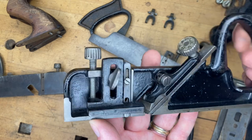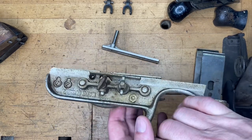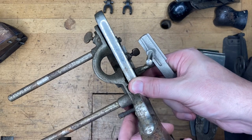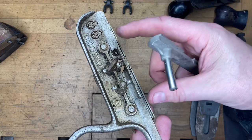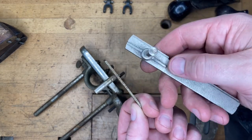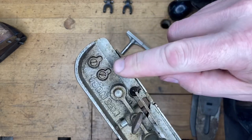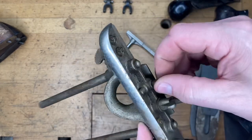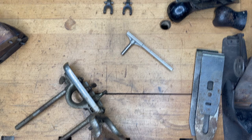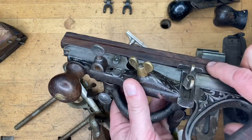There's another question that's come up lately: folks ask if the number 45 components are compatible with the number 50. This is a number 50 — you can think of it as a miniature version of the 45, a light combination plane. The stem on these for the depth stops is significantly smaller, so the answer is no — the 45 and 50 components are not compatible, to include the spurs. This style of spur on the number 50 is not the same as the three-prong or three-point knicker on the 45.